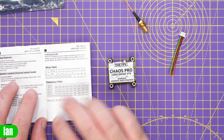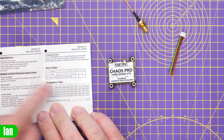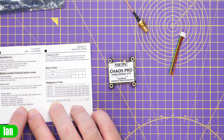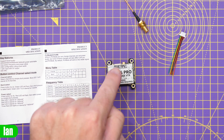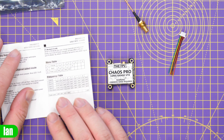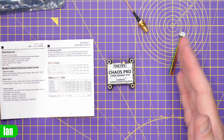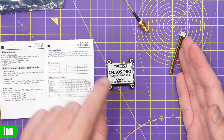The little instruction book shows us all the options available, so we can select the channels and everything like that, and then you can select the outputs via the button. It also supports PIT mode. It has that feature via the smart audio, so you have the option of controlling it either via your controller, your remote, or via an app, or you can do it via the button on the side.